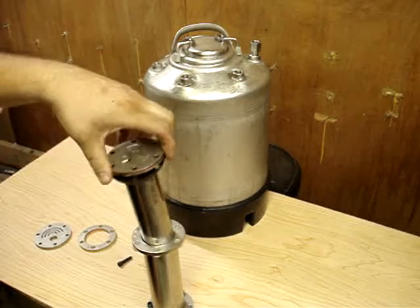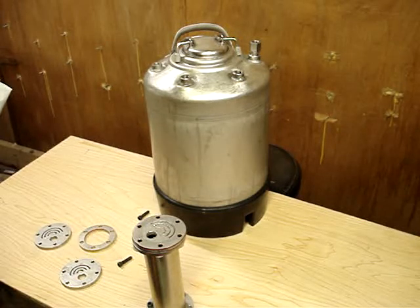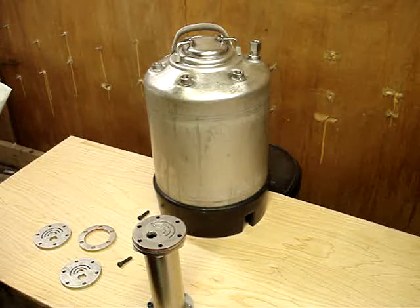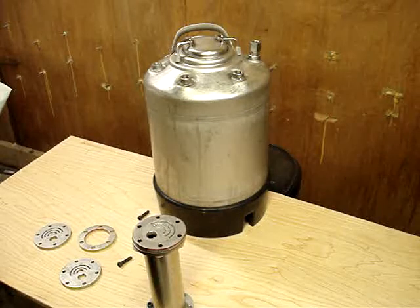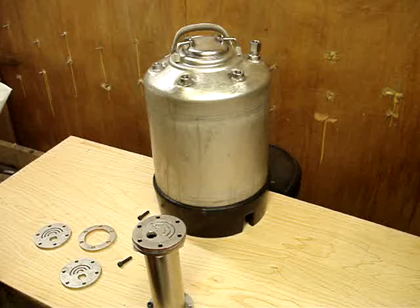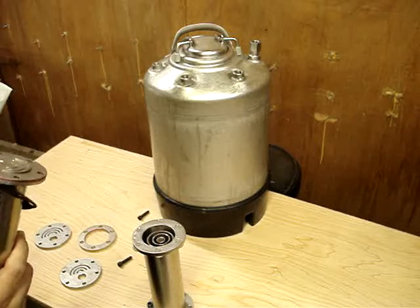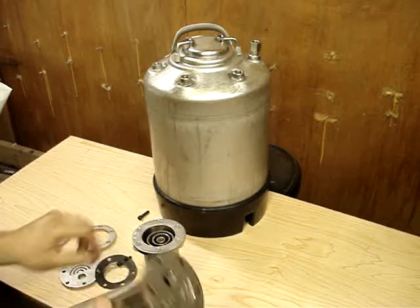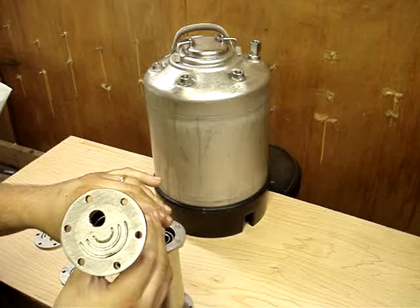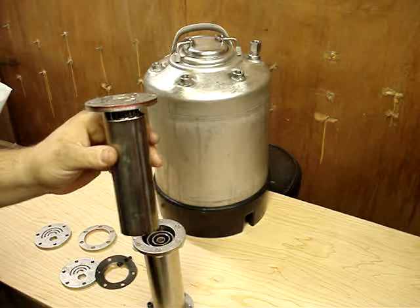It's fitting together quite nicely. I'm hoping that once I have these welded together I will not have to use nylon or any other type of wire tie to keep the tubes apart, so that they are able to vibrate freely without being restricted by being locked down with wire ties. The ends of these tubes are cut out so that the water coming in and going out cross-flows from one side to the other.